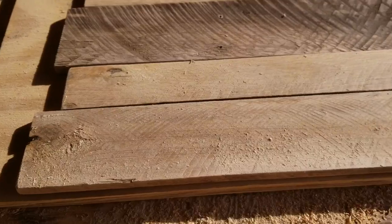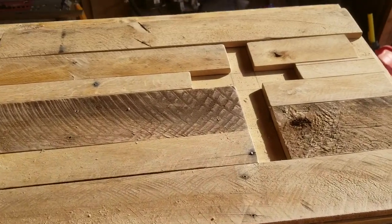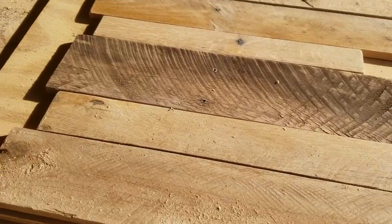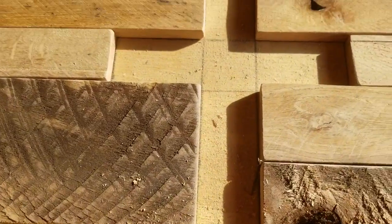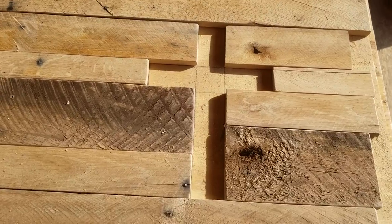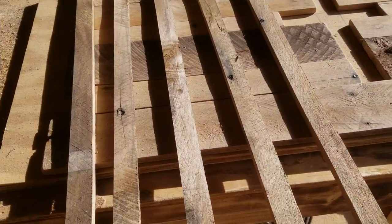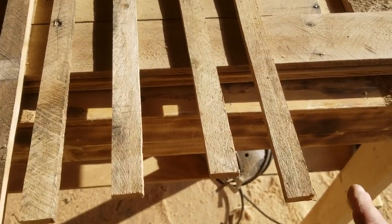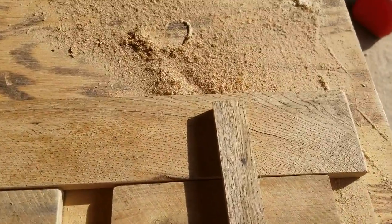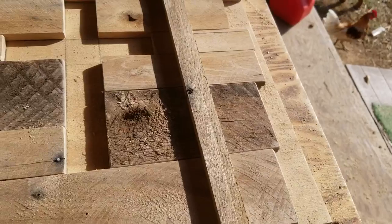Now that the front side is sanded real well, I've flipped it all over so you're looking at the back side, which is smooth. This is not going to be stained — it's just extra work for something you're not going to see. If you line up all the lines on your cross, you'll see a really nice pretty cross. I took some leftover slats and ripped them down to one inch. I'll cut them a half inch from the top, half inch from the bottom, come in here with my countersink, drill holes, and run one inch coarse drywall screws in through the back.